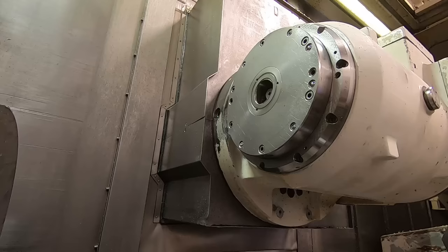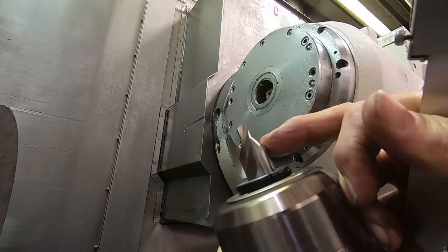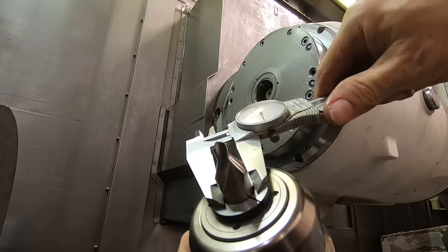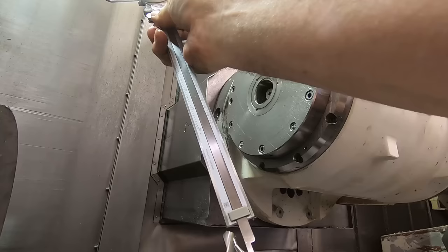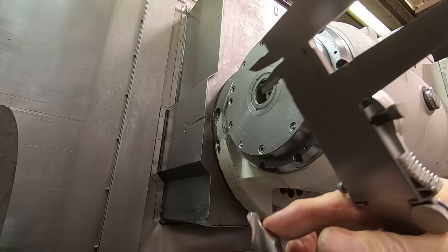One interesting fact about center drills is that if you want to get the maximum diameter on the drill when you drill, it's equal to the diameter of the shank. See, so if this is a 3/4 inch shank center drill, and the depth you go to is 3/4 of an inch, you get to the maximum size of the diameter of the taper on standard ground center drills.